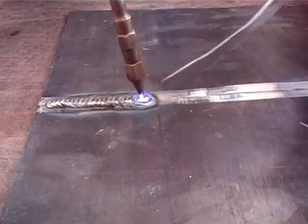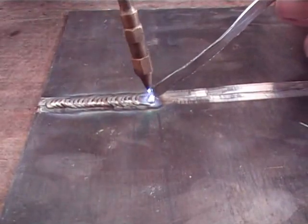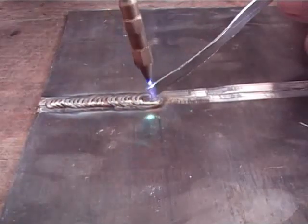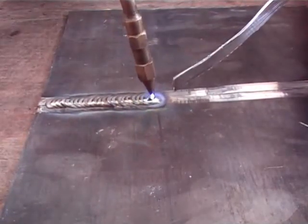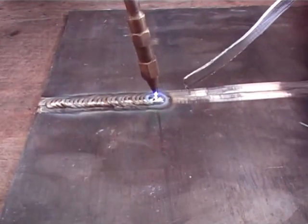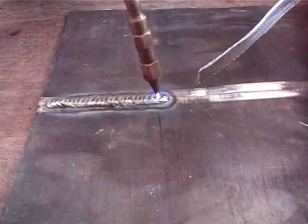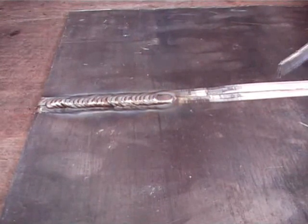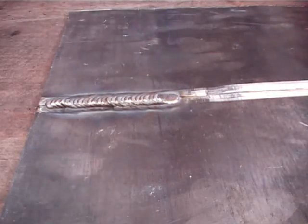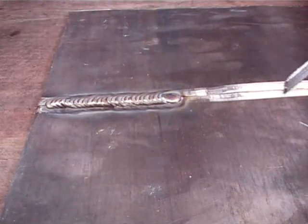Look at the angle — the gun I'm holding is almost vertical. You should be pointing slightly in the direction you're welding, so 2 to 5 degrees, no more. If you flatten it out and hold it flatter, the molten metal is going to run away from the flame and run in the direction you're pointing the flame. Also, get really in close — the blue tip of the flame should be nearly in the molten metal, so you're welding 1 or 2mm above that molten metal.